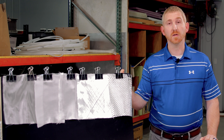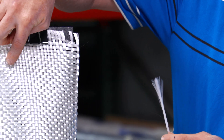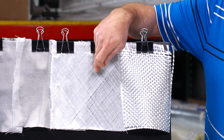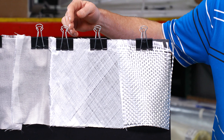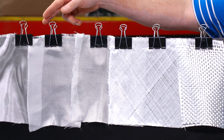The thing to think about with fiberglass — what is fiberglass? It's actually a reinforcing fabric and we have a number of them here. This first one is called a woven roving, which has mini continuous fiber filaments that are woven together. Next to it is called a knit — a biaxial glass run on a plus or minus 45-degree angle with stitching that stitches the two fabrics together. Right next to it we have yarns that are woven together and these are lighter weight — we have a six ounce and a four ounce, then a lightweight veil, which is very lightweight fiberglass fabric.